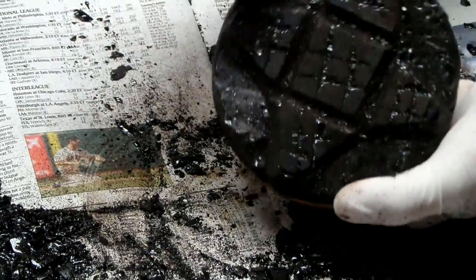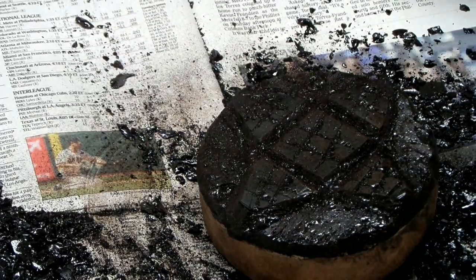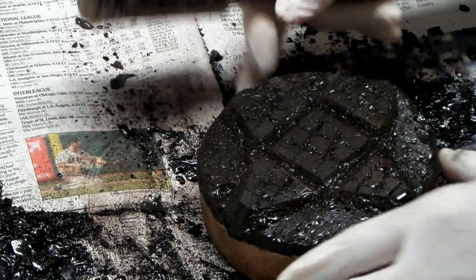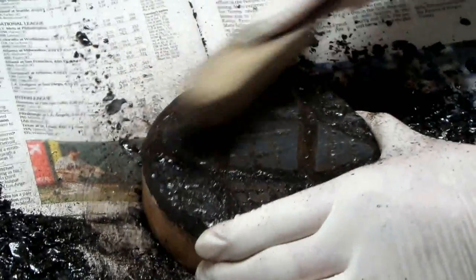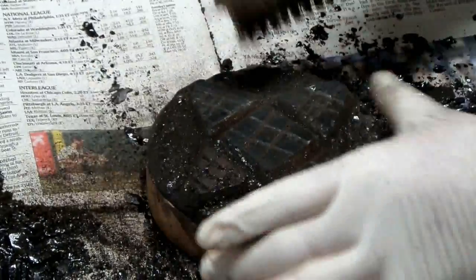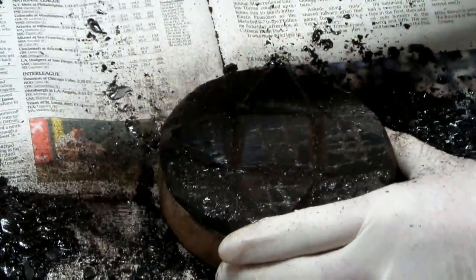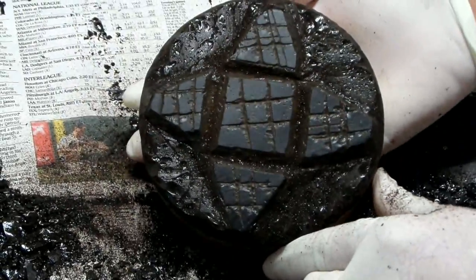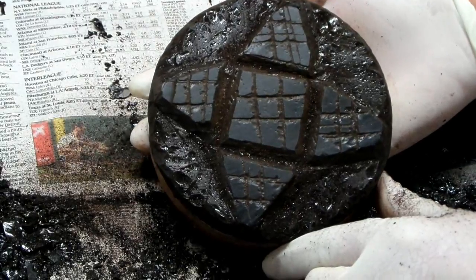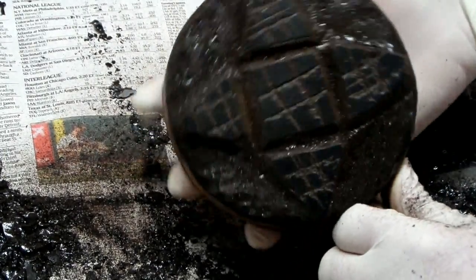Now I've got a pretty well-done polisher. The last step — I take my old beat-up brass brush and brush the surface of this polisher. You want to brush until all of the shininess is gone, down to a dull pitch surface. I do that before every session that I use this polisher. Before I actually use this on the mirror I'll of course wash it with running water and do a quick cold press. But basically that's how we make a pitch polisher.